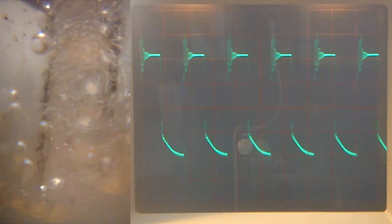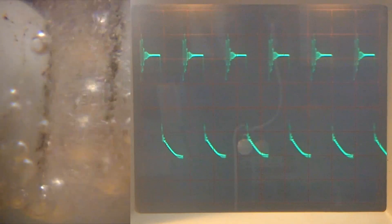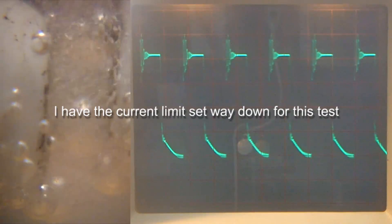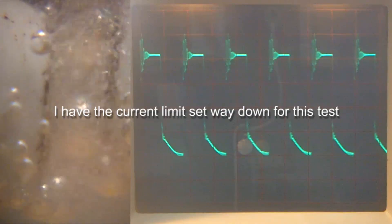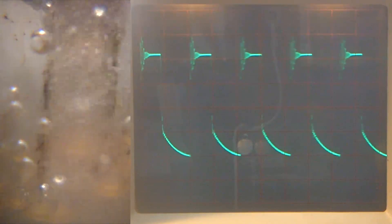So I don't know what's happening in this cell. That's going into a current limit now. Incidentally, that's almost 28 volts at about 350 milliamps there. I'm going to say I've got a snubber resistor getting hot, so I'm going to back off.